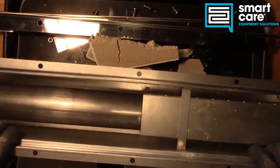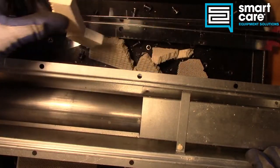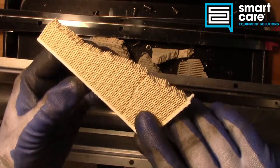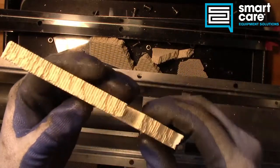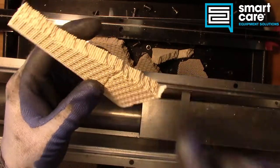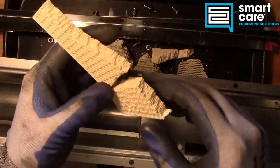When we talk about how it fails, it's almost always a broken tile or damaged gasketing. Because these ceramic tiles get so hot, if they're hot and they're splashed with water, that thermal stress can crack them. Or in the case of this burner, mechanical force — something hit this and pushed it in and broke the ceramic matrix.